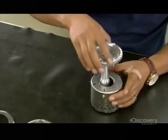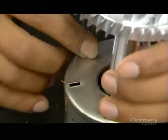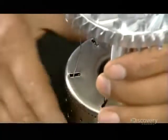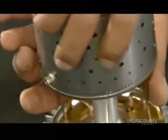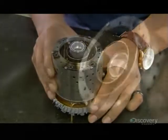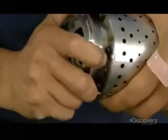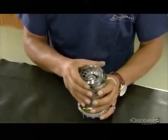He now holds the base plate unit above the combustion chamber while he inserts the tiny fuel delivery tubes into the chamber. He flips the chamber around to slide the tubes further inside and complete the job. The stator vane, pressed onto the other end of the chamber, will redirect the flow of gases to the turbine wheel.